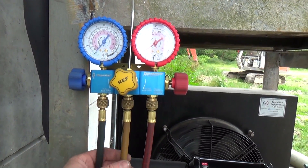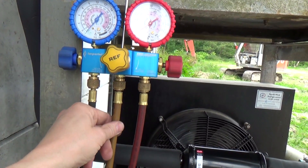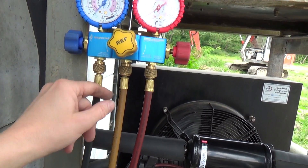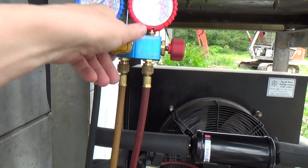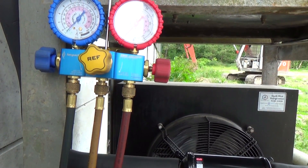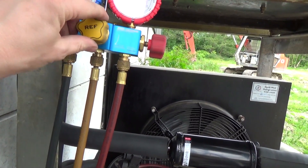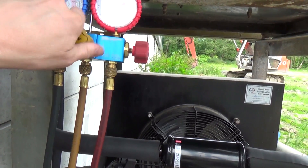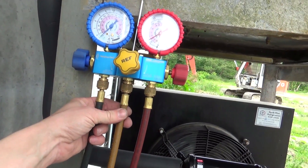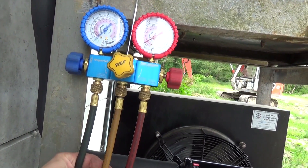Some new gauges — my old Refco ones started leaking. I just thought this was going to be a tap to shut the yellow line off, but it isn't. If you've got it this way over, it's full bore for liquid, vacuum and stuff like that. If you put it over this way, it meters it, so you can put liquid in and it'll get into the suction without damaging the compressor. I'm not sure how useful that's going to be — usually I just charge them with a tap. I need a set of gauges and that's what they had at the wholesalers.